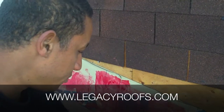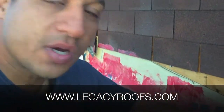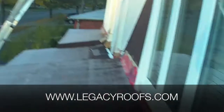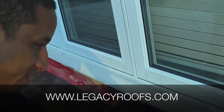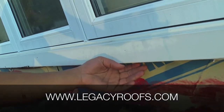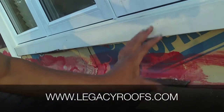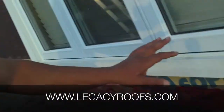This is our base sheet. We applied our base sheet to the field of the roof and brought it up this detail, then primed it. We're going to have a cap flashing and then new shingles coming below that — that's what's going to make it watertight. In this detail we removed the existing metal flashing and did the same thing, bringing our base sheet up and underneath. We don't want snow and ice building up here in the winter, which would turn to water when it melts. So we brought our ice and water shield underneath, then put the existing flashing back on.